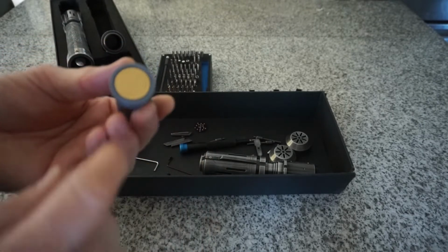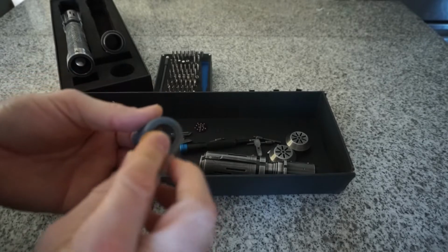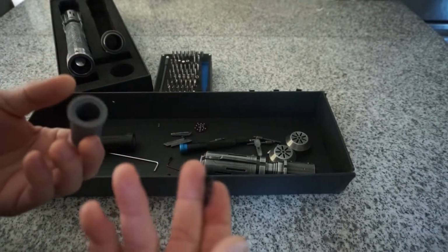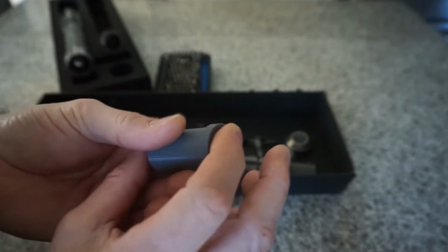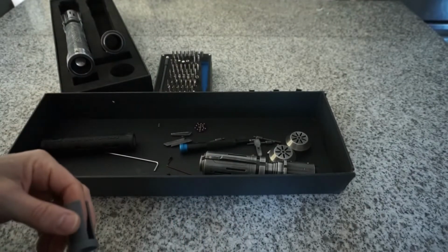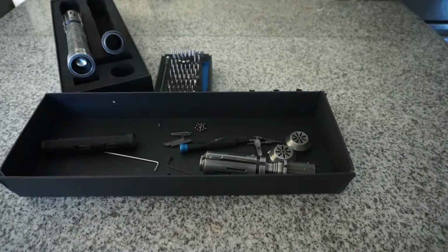This one's not as press fit, so maybe a little hot glue. What I would do is maybe 4 dots, and then quickly push it and hold it in place until it dries, which is like 10 seconds anyway. Otherwise, maybe some E6000, and then just some tape around that to hold it in place until it cures. Okay, so that's that part. So let's put that over there. So that's part 1, right?